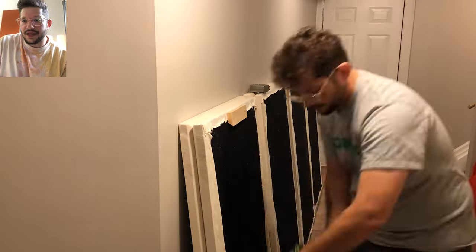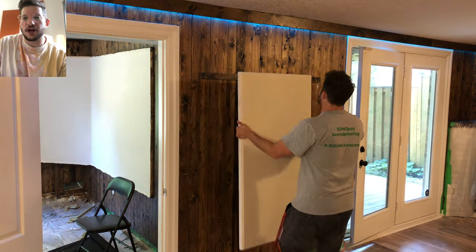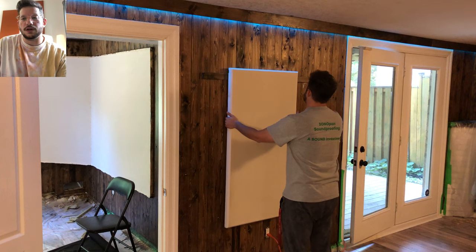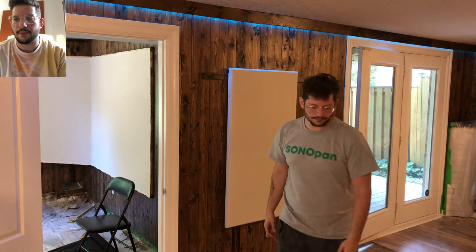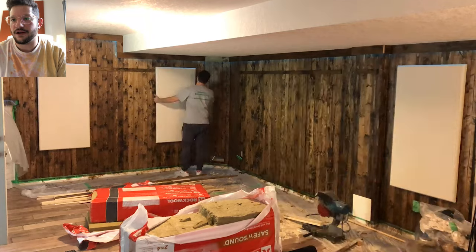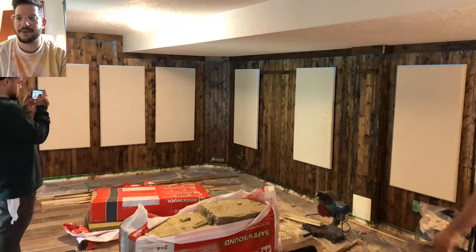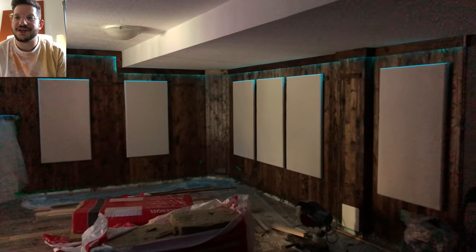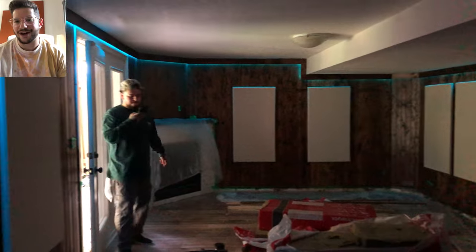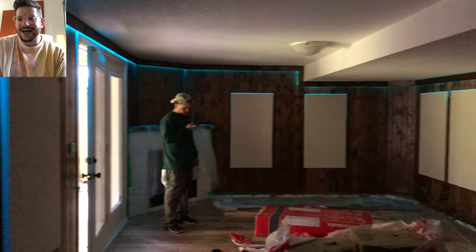I'm tacking the French cleat on the panel side of the frames — tacking on both top and bottom, because the top links into the wall cleat and the bottom acts as a spacer so the panel sits nice and flat against the wall. There you can see the very first panel getting put onto the French cleat. Here's Christian and I getting these panels put up around the room. Here's a cool look at the panels all installed — you can see how that light really hits off the top frames of those panels. With that 45-degree chamfered edge, the panels really pop in the room and give a really cool look. The client was super happy with it, and so was I — just a really custom touch for this client's room.